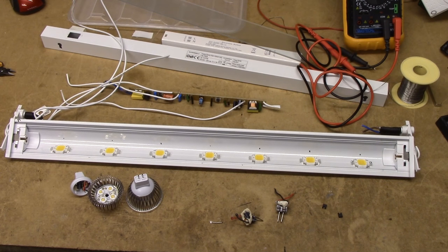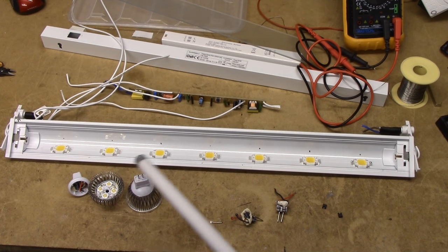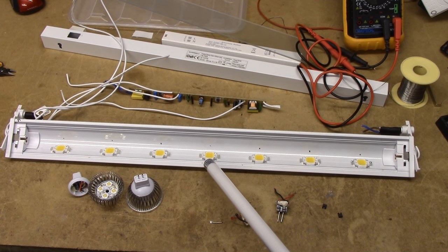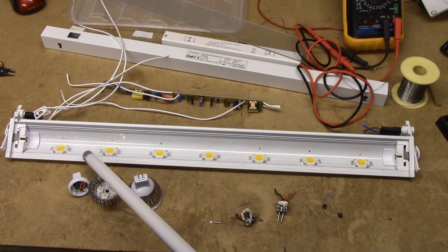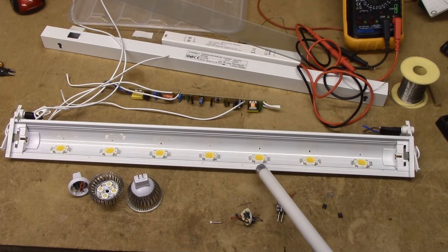They provide a fairly steady 600mA drive to these LEDs. The original fixtures have two LEDs in series, but they seem to work just fine with these LED COB lights, which have three in series. What I plan to do is to put one driver for each pair of LEDs in the ends, and one driver for the three in the middle. Since I ended up using an uneven number of LEDs, I figured it would be best to allow for slightly higher power dissipation out in the edges and reduce it in the middle. Since we're dealing with just a further reduction in output power, I don't think it's going to be too visible to the human eye.